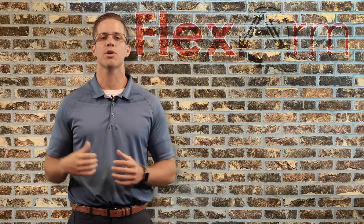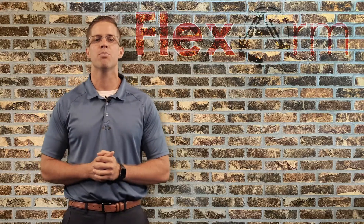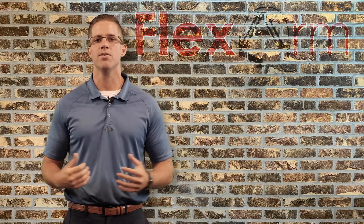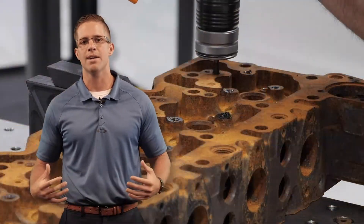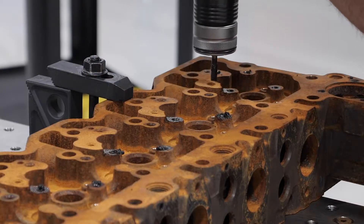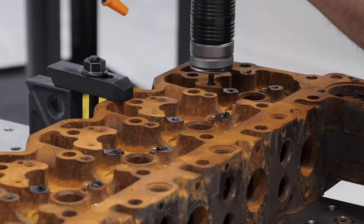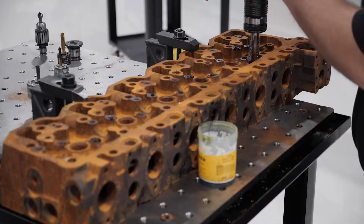We recently had a prospect cruise up to our facility for a tapping test. Our friend Drew from D&J Precision Machine was interested in taking a quick look at one of our hydraulic units. They're tapping into cast iron parts ranging anywhere from an M6 up to an M24, looking to tap and chase parts vertically and horizontally. So we kitted them up with the GHM18.